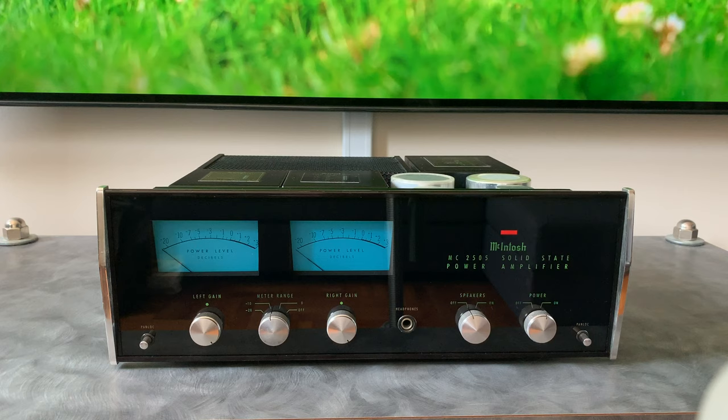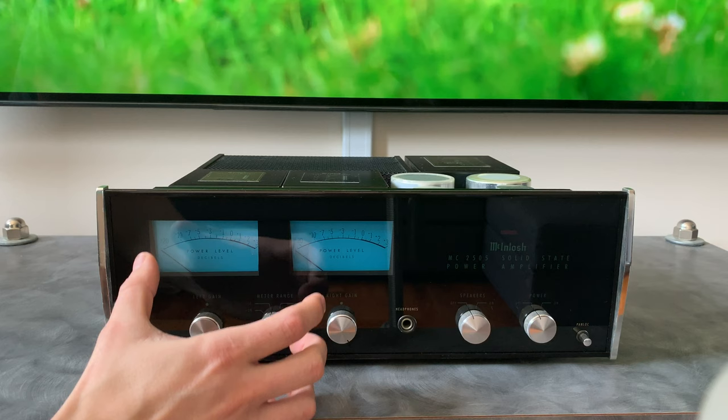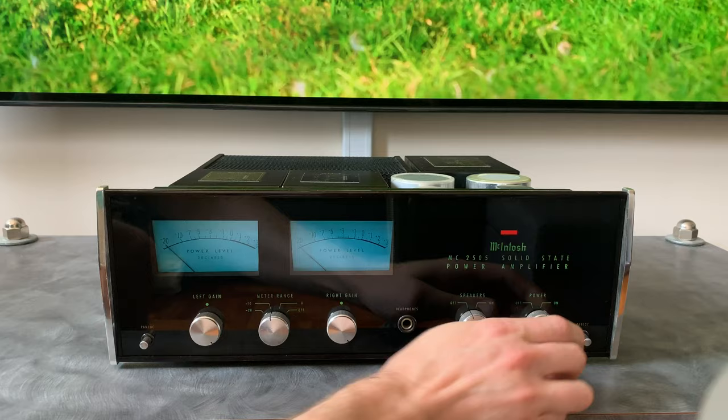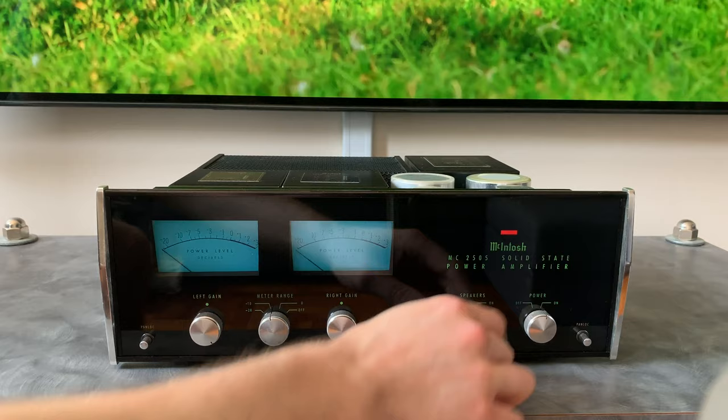All right, so just a quick note on powering this guy up. You'll see at the beginning when the power supply first comes online, these needles are gonna do a little bit of jumping. So I always recommend when turning on a piece, especially of this vintage, that when you have the option where you can cut the speakers out, you power it on first. You wait for that little blip, the power supply to stabilize, and then you go ahead and click on your speakers. For this first test, I'm gonna leave this off because we're gonna feed a sine wave into this device.